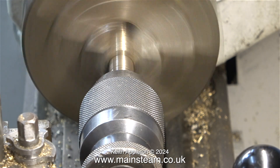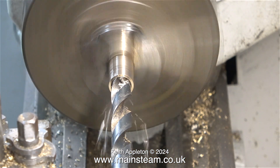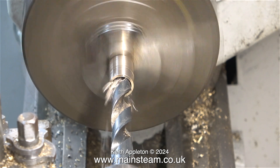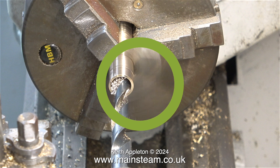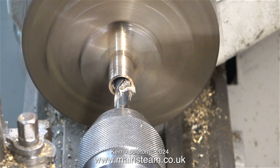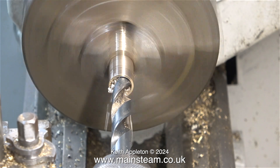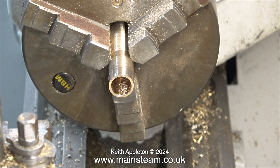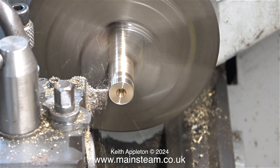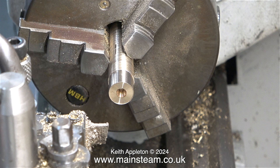This won't be a centre flue until I've drilled a hole down the centre of it. It's not a good idea to use a large drill bit because it only goes down as far as the centre drill, then it suddenly becomes very hard to penetrate and gets extremely hot. A better way to do it is to start the drilling operation with a much smaller twist drill. I need to drill this flue from both ends because the other end has to be reduced so the chimney fits on top of it, and if I push this drill all the way through there won't be any metal left for the chimney to sit on. So having drilled almost all the way through with the large drill bit, I turn the part around in the chuck and now I'm turning the register for the chimney.